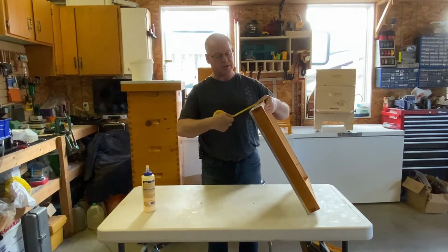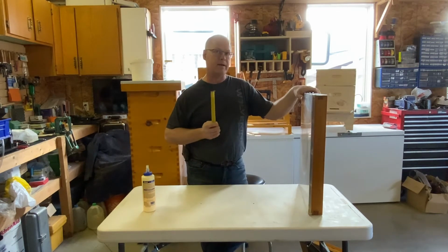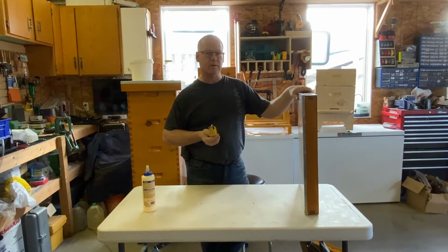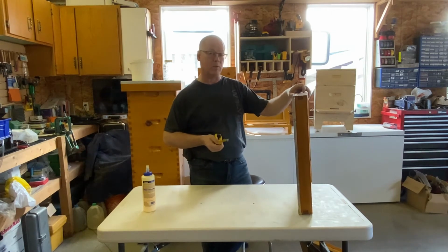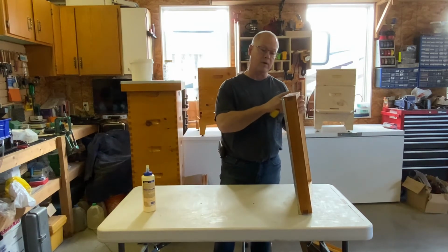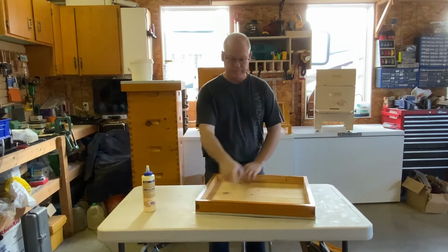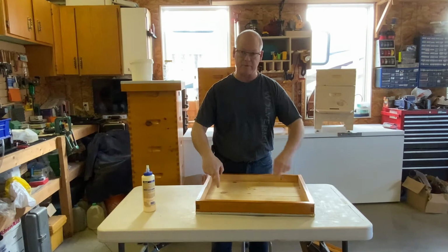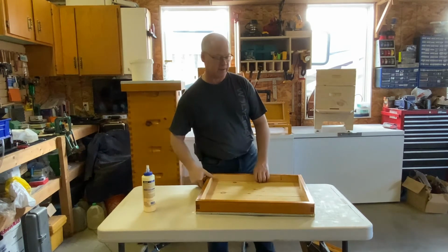These are going to be 2 and a half, and if I remember right, the last one I made it out of a 1x6, which gave me 2 5/8, and then I had to rip the board once with the width of my saw blade. So I'll go cut it 2 5/8 wide, and inside measurements 17 inches wide, 20 and a half inches long. I'll be right back.